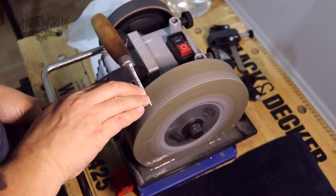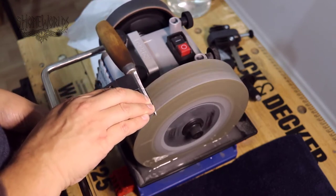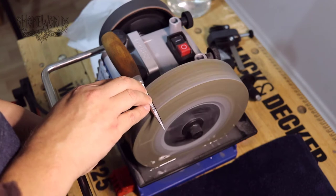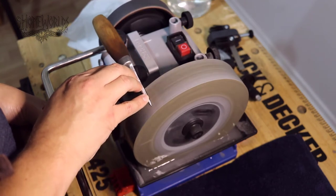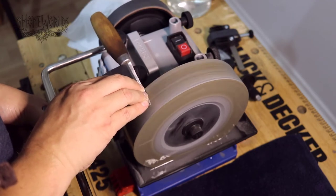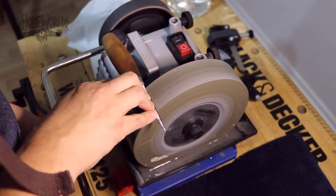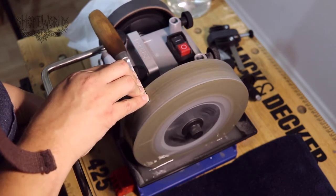Right here I'm slowing it down so you can see me hold it with the fingertips. From some angles my thumb covers it — next time maybe I'll film from the other side. But this is a good way to see me actually guide the bevel. At each point where it needs to be on the stone the most, that's where you'll see my fingers applying pressure. I apply a lot of pressure at certain spots because some areas are more troublesome than others.